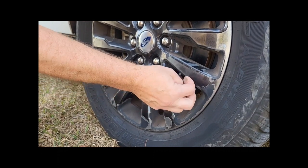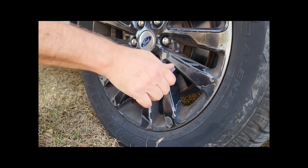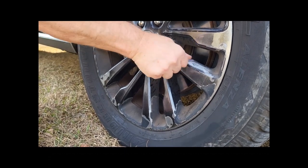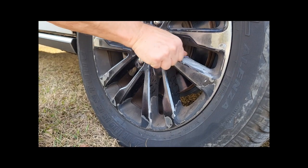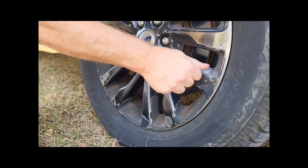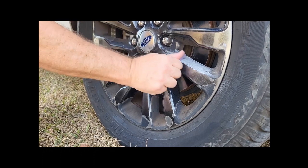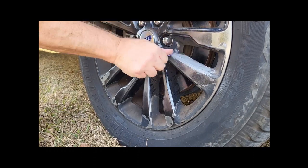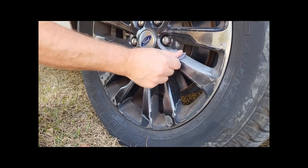Here I'm showing how some of the bigger pieces were just flaking and peeling right off. I'm using the 60-grit sandpaper to start, and you can see the flakes just flying right off. I'm trying to get the bigger pieces off as I go through and sand. Once I get the bigger pieces off, I'll come back with the 220-grit to smooth out any roughness caused by the 60-grit sandpaper.